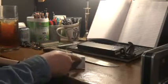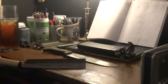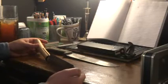And I think I'll get some relief due to the hollow bevel back here, this hollow grind, which should prevent a bit of sticking as well. The other interesting thing will be, am I going to see any control issues, because this is chisel ground. Flat right here with a bit of a hollow relief, and again, the grind is on this side. So will I see any drifting of the blade? So those are the three big things that I'm going to be looking at.